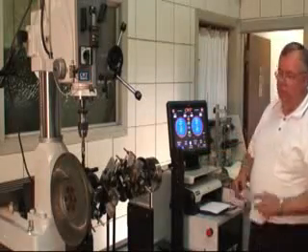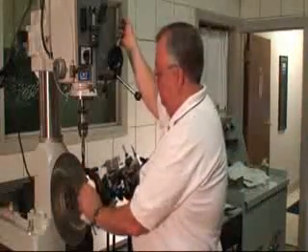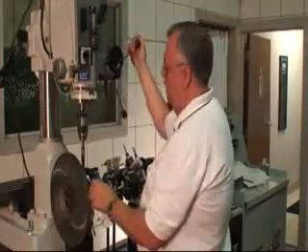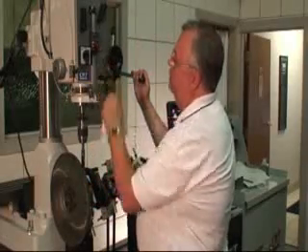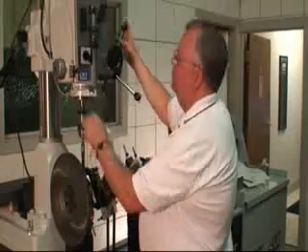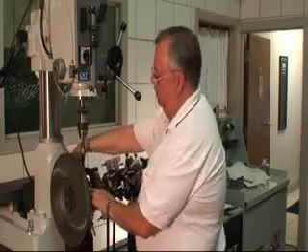Now you'll see it wants to be drilled 590 thousandths. I'm going to pull back and get into our hole here. We're going to come down and zero out. Back off, start out. We're actually going to stop and protect this bearing with a rag.